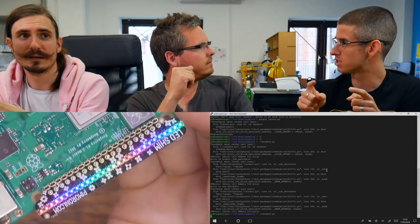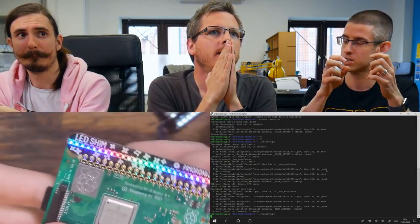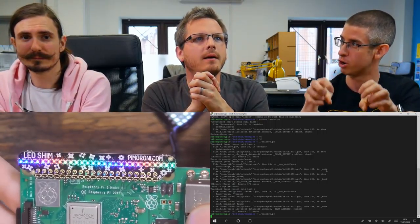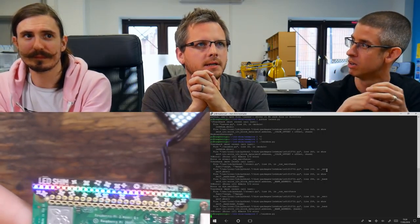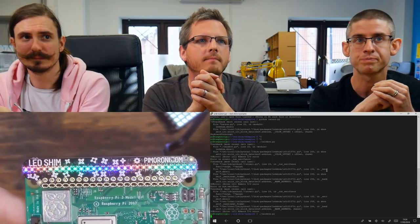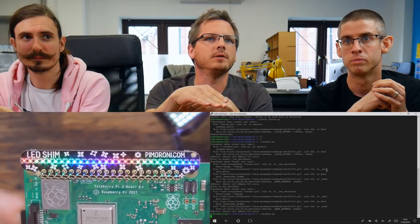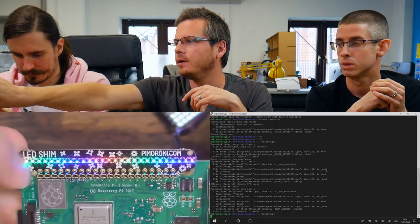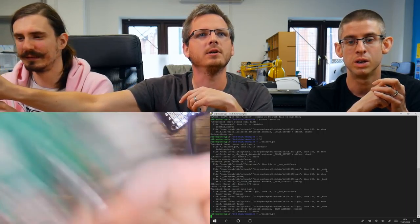The idea is the bottom row of elongated slots, because the edge of it is so thin, it flexes slightly when you put it on. It's actually slightly smaller than the pin diameter. Exactly that. And then it flexes and grips onto the pin. You get that bottom edge, just a very slight deformation in it when it's inserted onto the GPIO header, which is enough to hold it in place, like Phil's showing. I can pull his Pi around just by pulling the board. It's not going to fall off.